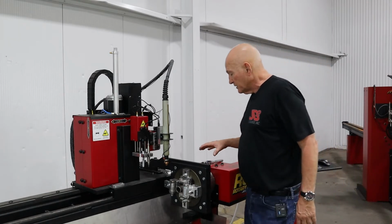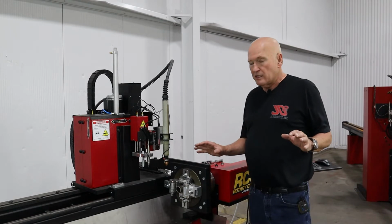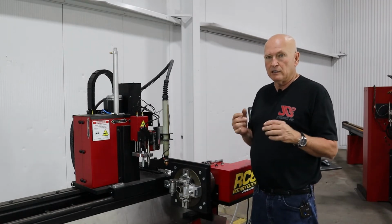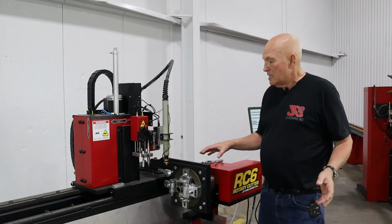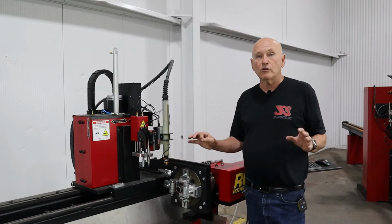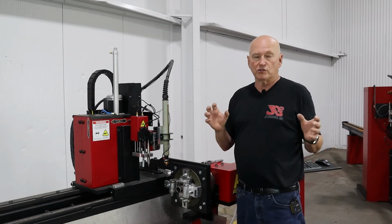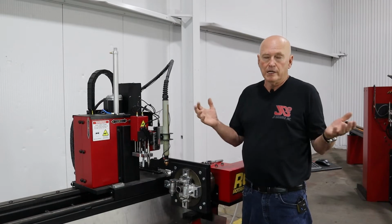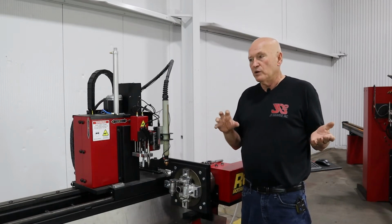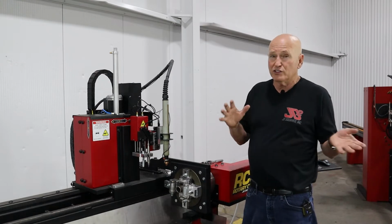All right, let's go ahead and set the height of the chuck. One thing to keep in mind is that the square stabilizer versus the round stabilizer, the square is a more accurately machined piece. The reason for that is we use transfer balls in the round stabilizer, and they have a certain amount of tolerance, just the way they are. That's the way we get them. We typically measure anywhere from plus or minus 15 thousandths of an inch, which isn't much.